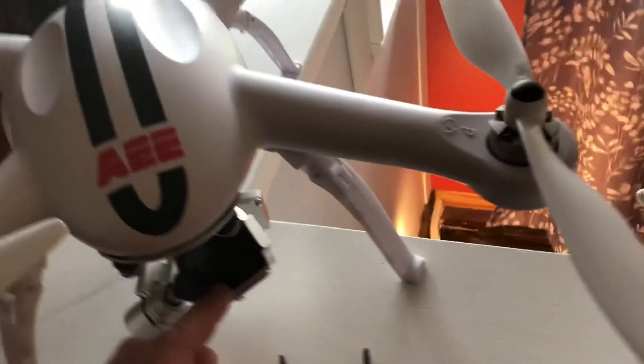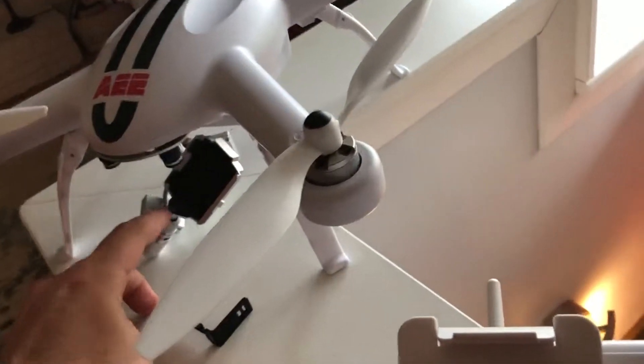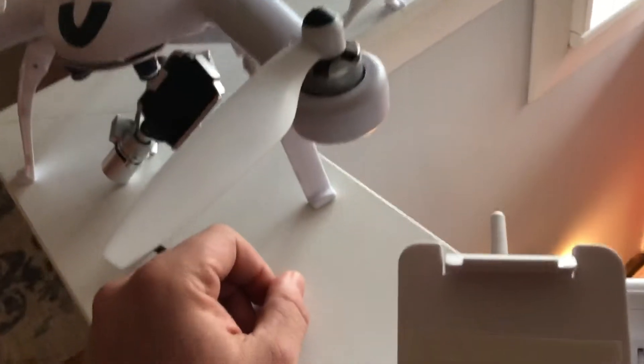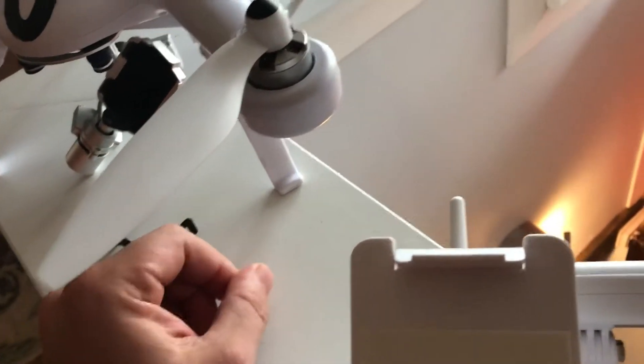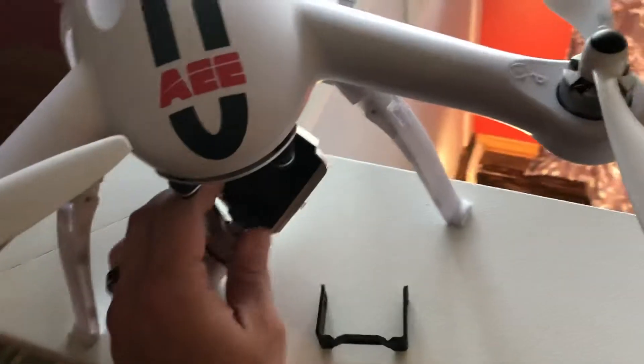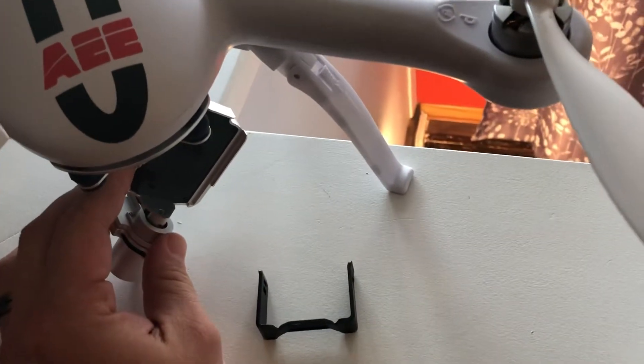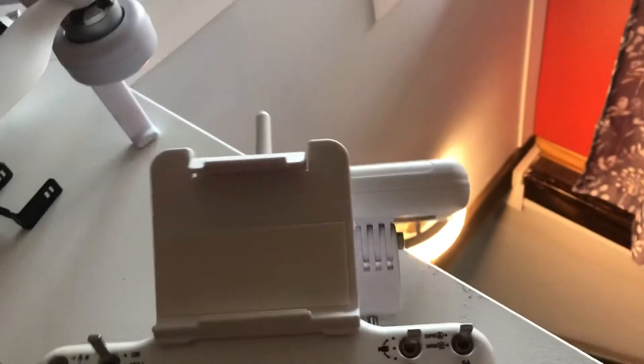You can also attach a GoPro — there are different cameras you can put on here as well — but so far I'm just going to stick with the one that comes with it. The tip I want to give: when you pair your Wi-Fi repeater to your camera, the easiest way I've found when using the app for first-person view while flying is to switch on the repeater, wait about a minute, then turn on your camera and wait another minute, then turn on Wi-Fi on your camera. By then your phone will be fully connected to the repeater first, and then the repeater will connect to the camera. That seems to give a more stable connection.